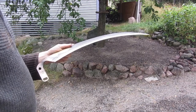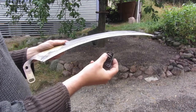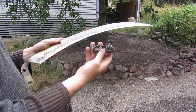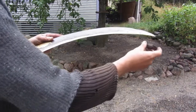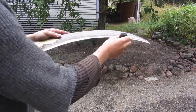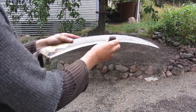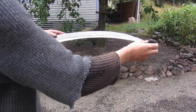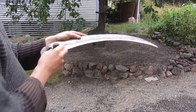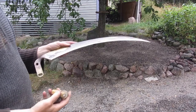I also have another wheel from a dismantled grinder — it's a much smaller wheel with a harder ceramic substance. I've used this one for five years or so on my kitchen knives and it's still going strong, so it's very difficult to wear it out. The same principle applies here and it works very well too. It's important that you use the finest grades of wheels that you can get, as coarser ones are too coarse for the scythe blade. How many times you have to do this depends on the edge, the shape of the primary edge, and whether you have honed it before.